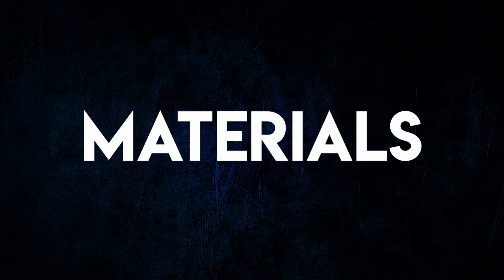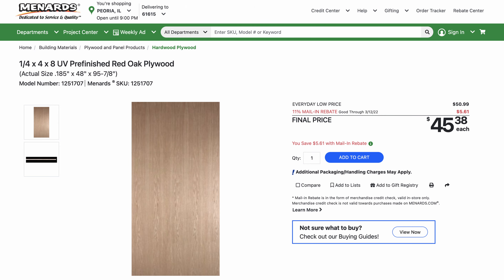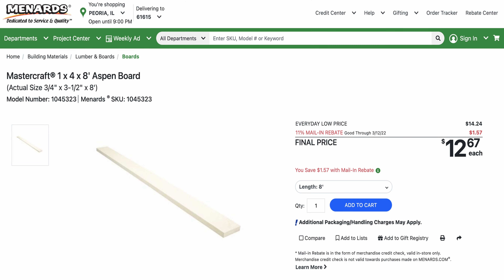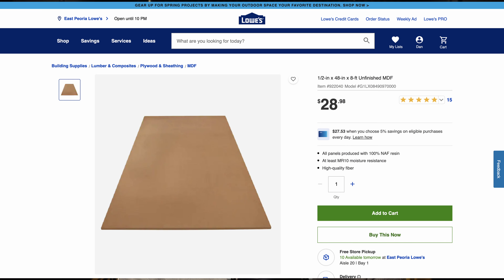For wood, I used quarter-inch oak plywood — not the MDF core, but actual ply — for about $45. I got three sheets of 4x8 quarter-inch maple plywood, also ply core, at $30 each, spending about $90. I got a piece of aspen, which was for the door edge to make it feel like one species, at $13 for a 1x4 eight-foot board, and an oak 1x4 board for $20 for the same purpose on the oak section. I also had a half-inch sheet of MDF — about $29 at Lowe's — plus another $30 or so for stain, sandpaper, and poly, putting us right in the $500 range.